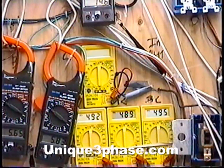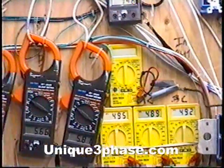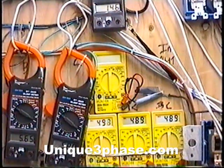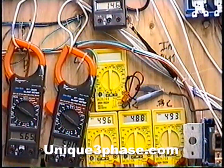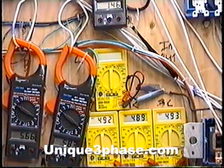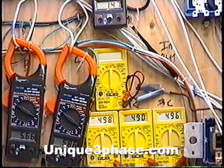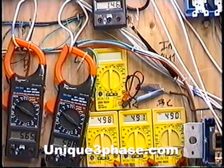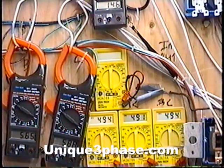The transformer is homemade — we've got about 800 feet of 12 gauge copper wire on there, and it's running this whole setup. We could adjust this: if we wanted 550, we could make it 550; if we wanted 415, we could make it 415. We're in charge because we're the ones making the transformer — we can have any voltage we want. We're running it on the 240 input, but if we had 330 volt or 180 volt input, we could do that. If we had low voltage because we were at the end of the power line, we could wind the transformer to compensate.